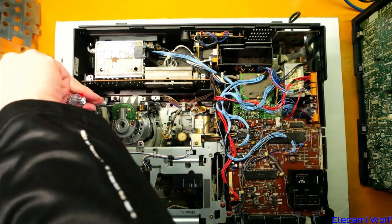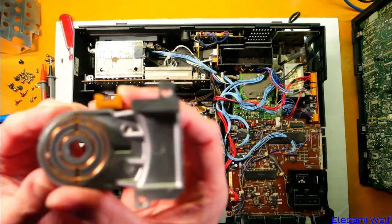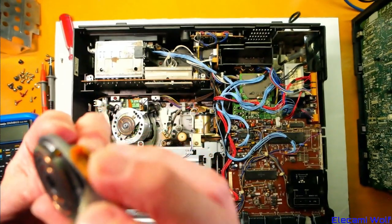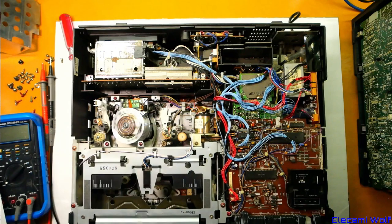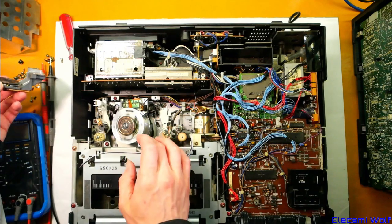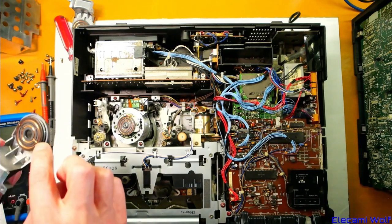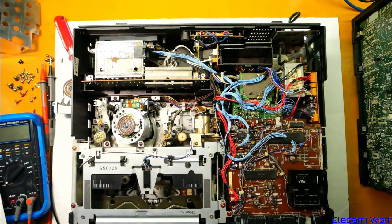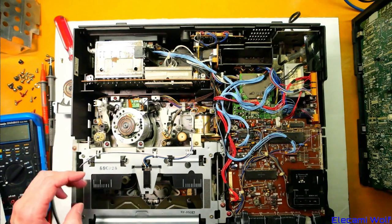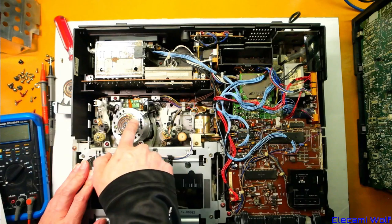So it's probably not going to be much better. But I want to know: are the bearings good in this one? Let's pull that top off in case it's the top ones that are the problem. Oh! That's not very good — there's corrosion all around that, and that's the internal ones. Oh, that's a shame. At least we got a good one of this top part that isn't corroded. But I think the internal windings are all ruined as well. Oh, those wires are gone.